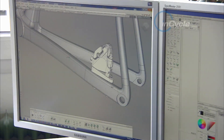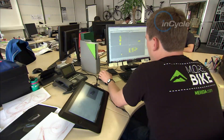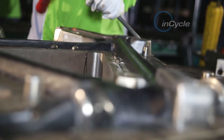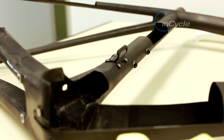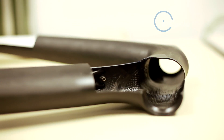You're now just able to squeeze the weight by 70 grams at the frame and potentially nothing at the fork. Where's the improvement? When we talk about carbon frame development and manufacturing, we have a situation where weight-wise there's no big space left. The new Scultura has wall thicknesses already at 0.3 millimeters — that's about three or four sheets of paper. Less wall thickness is simply not possible because otherwise the product will become too sensitive against punctual damages.